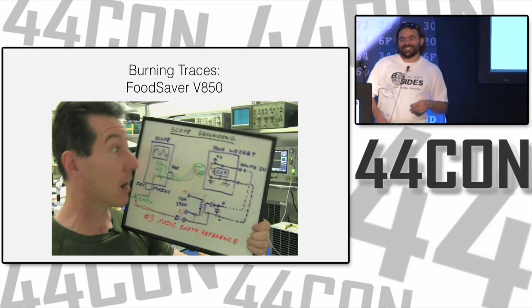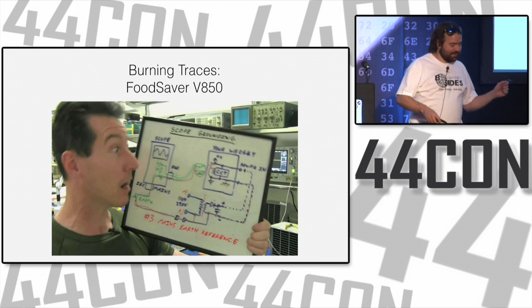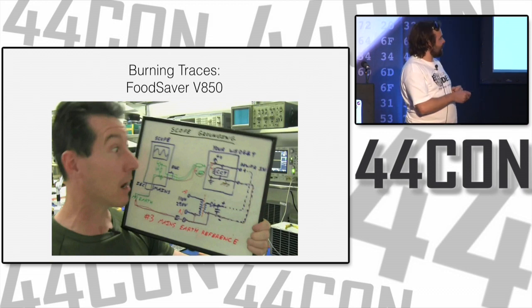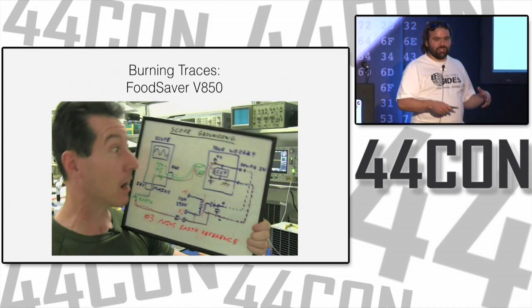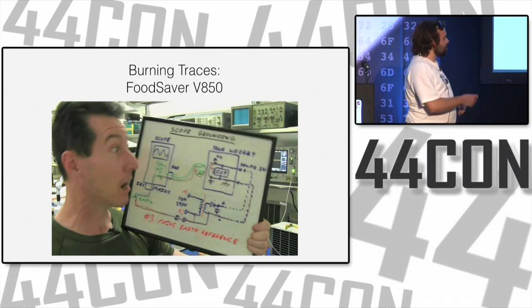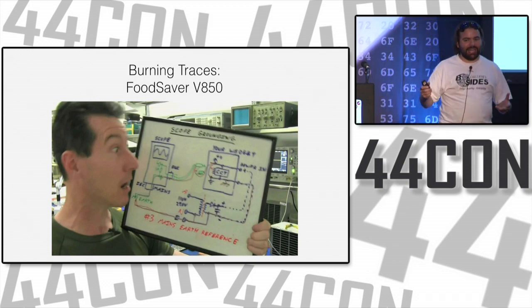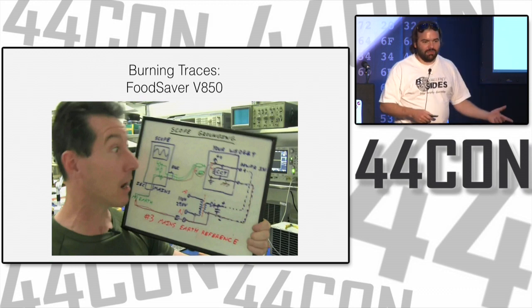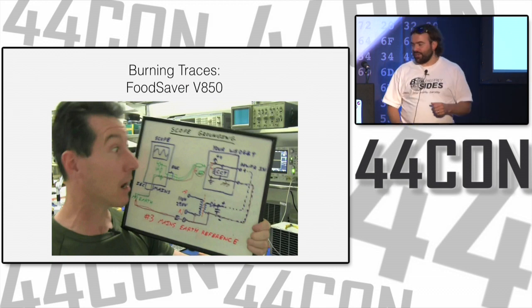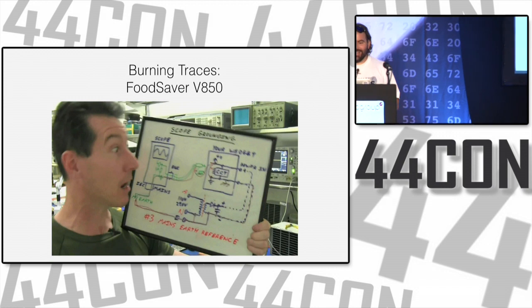Okay. So boom. This is Dave from EEVblog, and he has this kind of explanation: when you have things that are plugged into mains ground, you have to realize you're going to loop grounds together at some point in time. So we had an oscilloscope and a FoodSaver, and they were both grounded, and we touched things together, and we were now shorting with 120 volts, and bam. So, moral of the story, be careful.